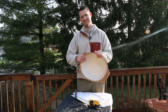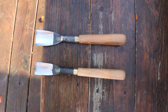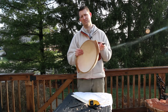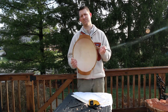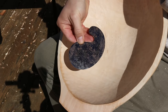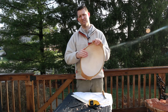For the inside of the bowl, similar concepts apply, but instead of straight gouges you're going to want a bent gouge because you won't be able to reach the inside without one. Just like the outside, the amount of sweep on your gouge dictates how subtle the carving marks are — more sweep means more visible marks, less sweep means more subtle. Consider what the bowl will be used for: if it's a salad bowl you want subtle marks for easier cleaning, but for a fruit or decorative bowl heavy carving marks can be a nice look. Another option, if you want no carving marks at all, is a curved scraper — though those remove very little wood at a time, so get a good finish with gouges before switching to the scraper.